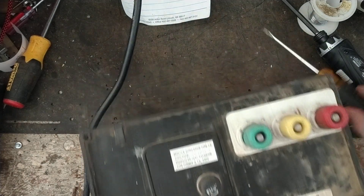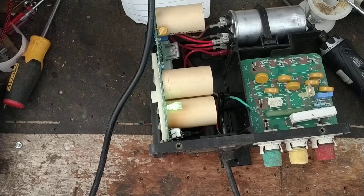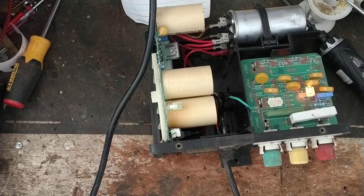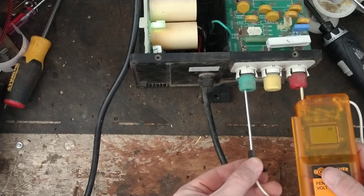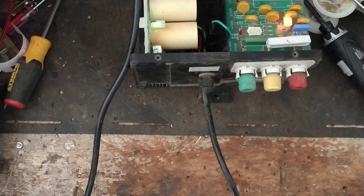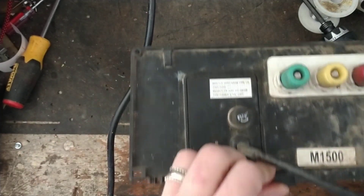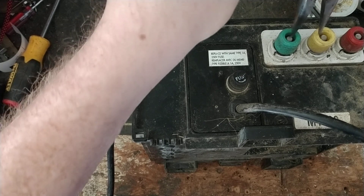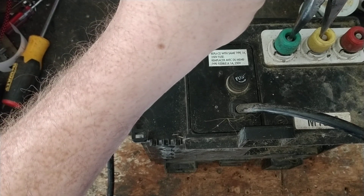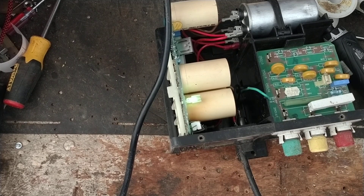It's a hard-hitting unit. Not the biggest Gallagher made back then or today, but it's a 15-joule unit that probably outputs around 10 joules — a pretty good punch, upper-middle-of-the-road size. A voltage test shows 8,000 volts out of it. Half power also reads 8,000 volts, but what changes with half power is how well it can handle the load. We'll do a spark jump on half power so you can see the difference — it's still probably 2, 3, or 4 joules, still packs a punch, probably stronger than some smaller units out there nowadays.